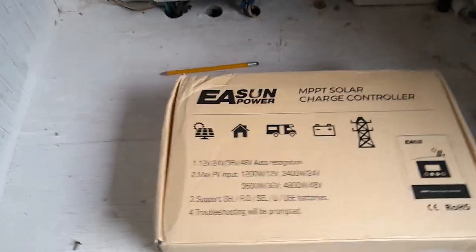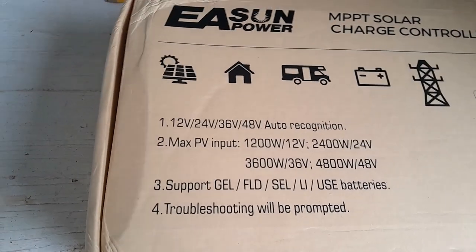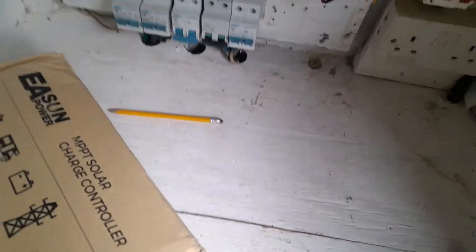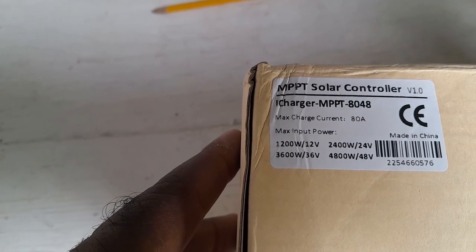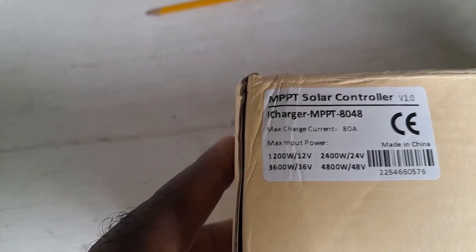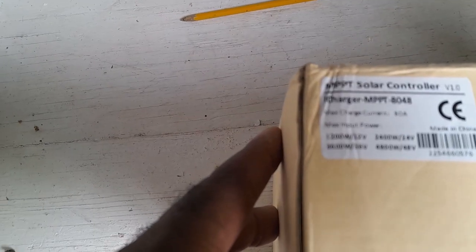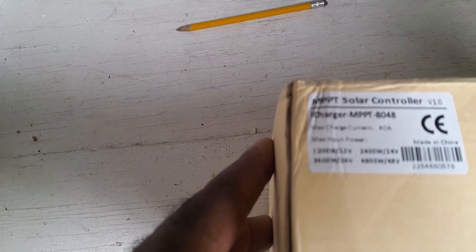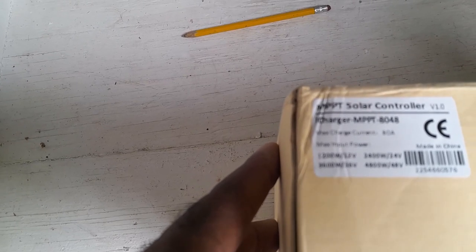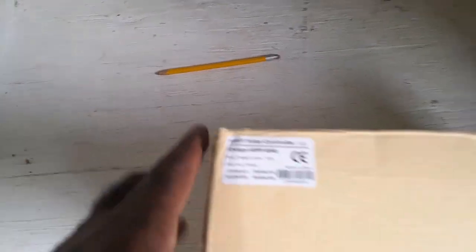So I'll be installing this controller. These are the specs, which I would also put in the description. It's an EAsun MPPT 8048, max charge current 80 amps, max input power 1200 watts at 12 volts, 2400 watts at 24 volts, 3600 watts at 36 volts, and 4800 watts at 48 volts.